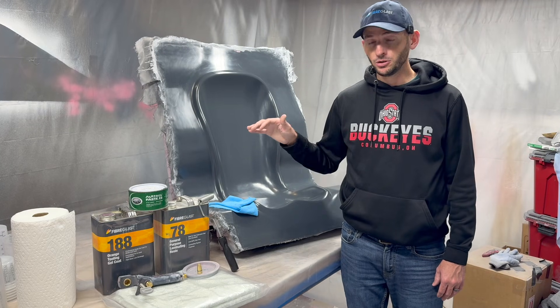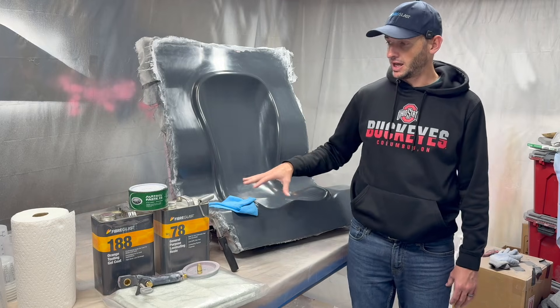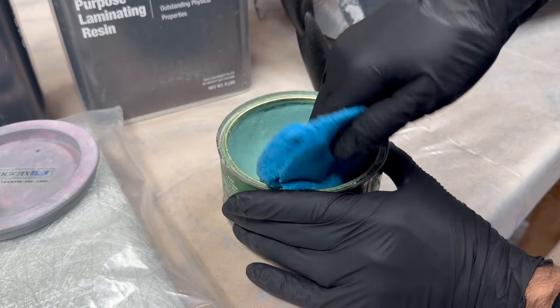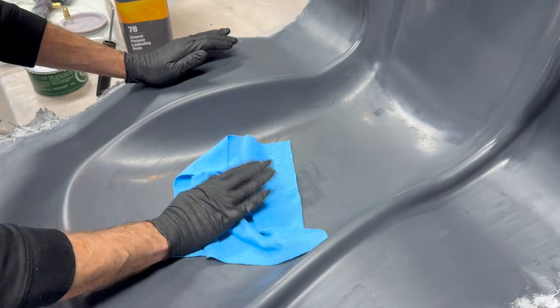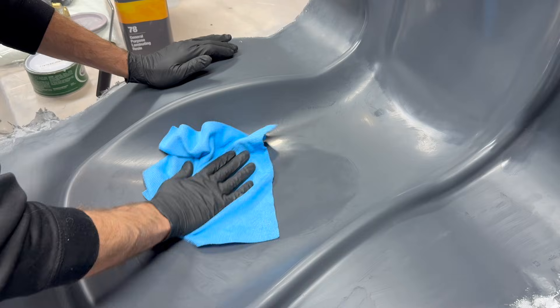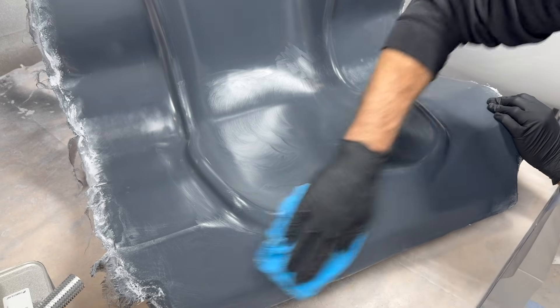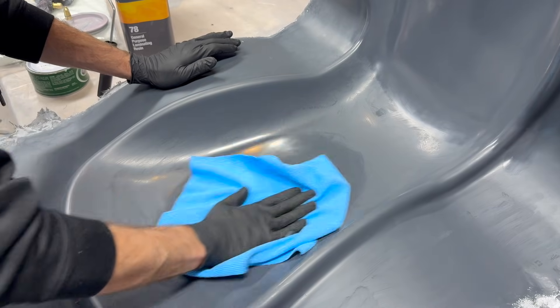For the mold I will be exclusively using this channel's sponsor's fiberglass material. The first layer that will go down is actually a mold release. My favorite is Part-All Paste Number Two. This goes on just as you would wax a car. You want to let that sit and get hazy. The goal here is to remove the excess wax but not actually buff too much of it off. I'm using a lot of microfiber towels and just getting it down to a nice polished surface. That should leave enough material on there to give you a barrier between this and the gel coat, because you don't want that stuff to stick.